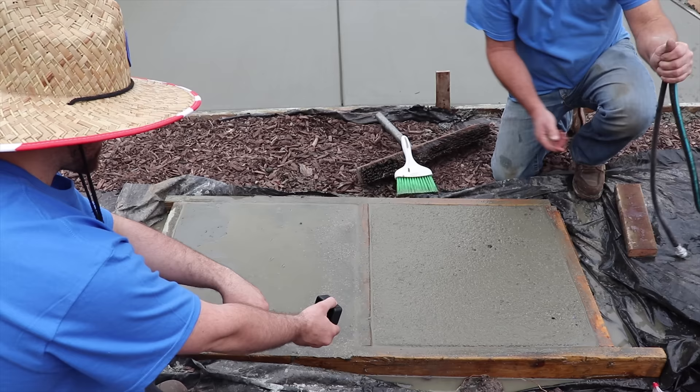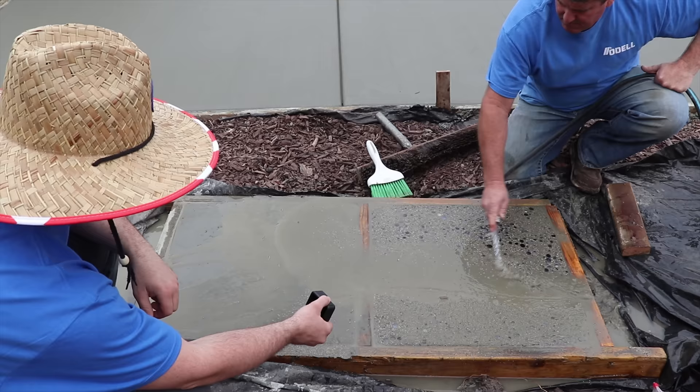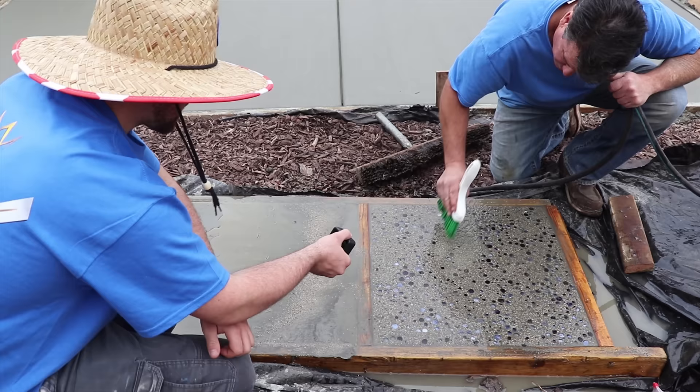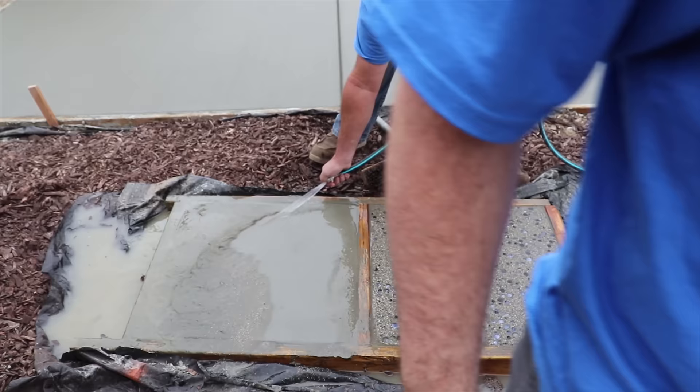That was pretty interesting how that fiber mesh just rolled out — if it's rolled off the top, that's when you know it's actually in there, when you can see it. I ended up going with a nylon brush, a little bit stiffer, because I almost waited too long to rinse this, actually. I could have gone about 15 minutes earlier, but it's better late than early — because if you go early, all these beads will just fall out. You'll have a real mess. So I had to scrub a little bit harder because I went late, but the beads are well embedded and they're not coming out.